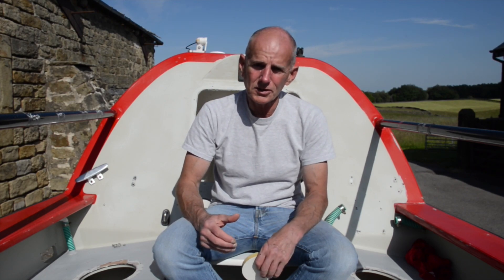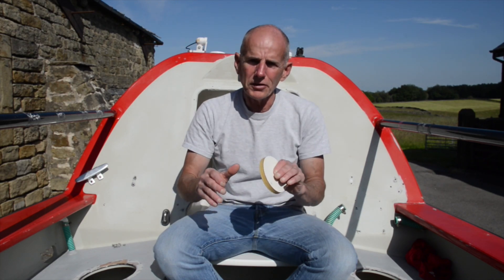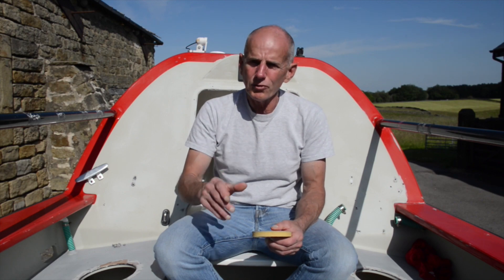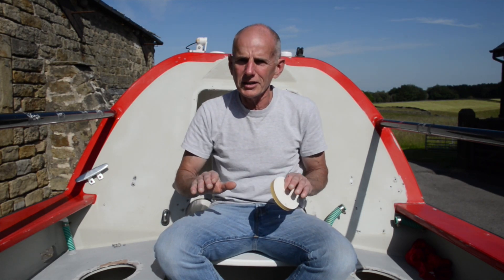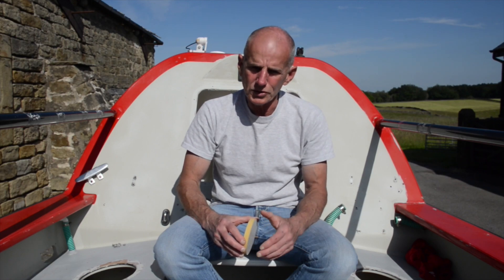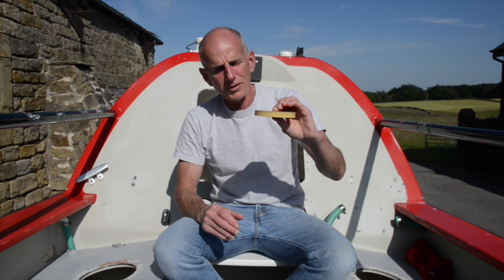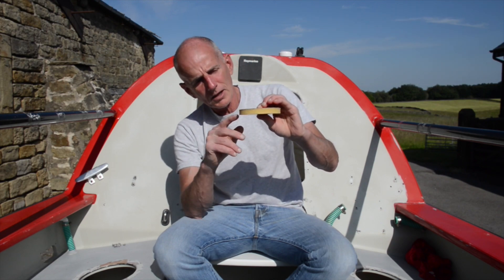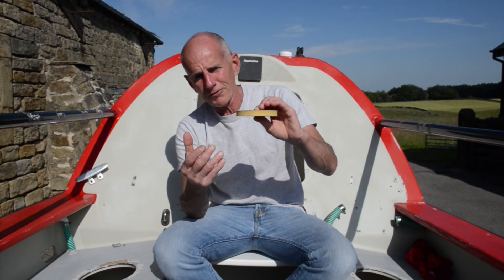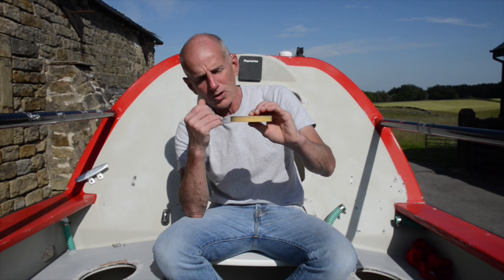They're called the Adkin design — very similar to Socks: big cabin at the back, very small transom, designed so that the wind flows over the boat. Everything that sticks up above the water catches some windage, but they're designed to not attract the wind as much as possible. The fore cabin slopes up and away so any wind that hits it runs off it. The transom on the boat is only 13 inches. Phil Morrison then designed another style of boat — Socks — with Jamie Fabrizio building most of the better versions. It's a composite boat: rather than plywood, it has closed-cell foam in the center. Unlike a bathroom sponge, the air pockets in this foam are sealed so water can't get in — it's very buoyant but not absorbent at all.